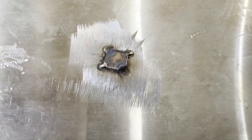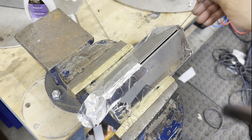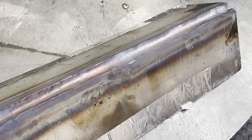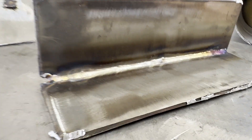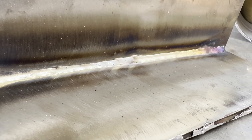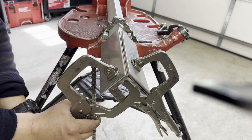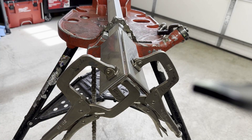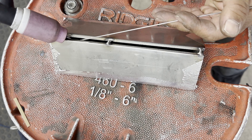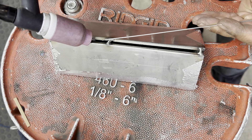Let me try the second one with a new purging jig. The gap is smaller than 3/32, so I picked the 1/16 filler wire this time. Okay, it is done — let's take a look at it. As I expected, it came out better than the first one. I've seen lots of people giving up practicing pipe open root because it requires lots of preparation. That's why I introduce an alternative way. Please build up your skills with a plate coupon — it is easy, quick, and money saving. Thanks for watching, and please subscribe and like if you like my TIG welding videos. See you next time.